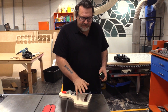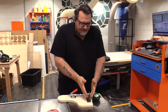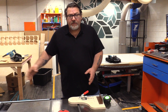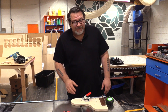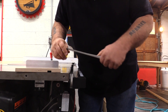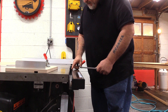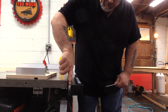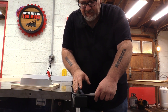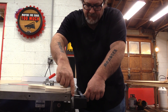The first thing to think about is how this clamps onto our bar. The bar of our table saw goes in here and then this clamps onto it, so you need to have enough room for this piece of angled aluminum to go in between the saw and the bar that your table saw fence slides up and down. You need at least an eighth to three-sixteenths of an inch for this angled piece of aluminum to fit in between the front of the bar and the table saw itself.